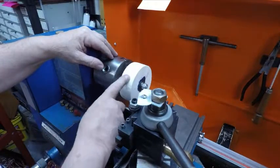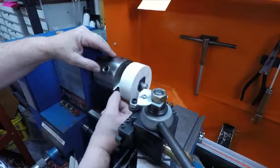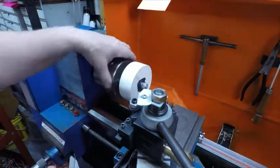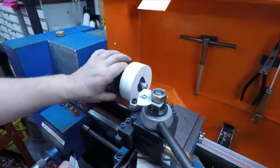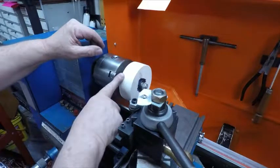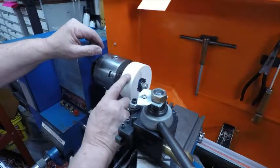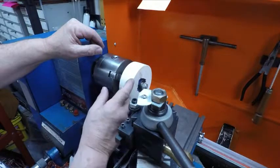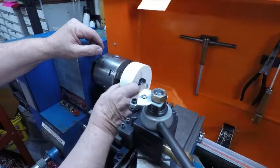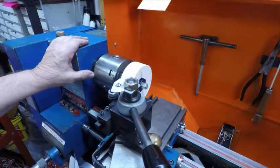I spun it on there and I'm looking at it, and I thought — you know, you could make rollers for your mower. For under the deck, they have them little rollers, but they're always cut way back in here. You could make it out of this stuff. It'd probably cost a lot more than what they sell — you could probably buy them cheaper. But you could make that, and as long as you had the bolt right, you'd need a shoulder bolt. You could lock on another nut and put red Loctite on it, and you could actually machine this across and taper it down and around, and make a set of those rollers. You could make yours as thick as theirs. But I've got this ready to cut. Let's try it.